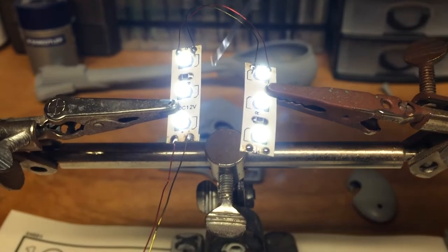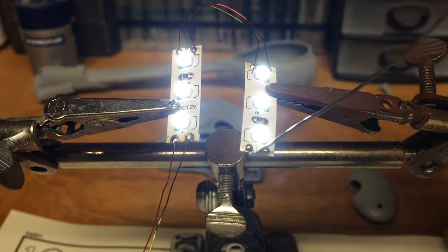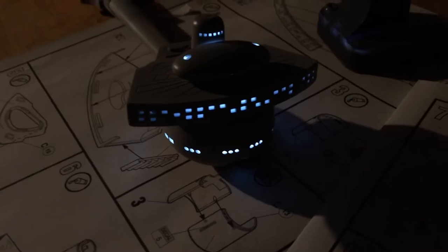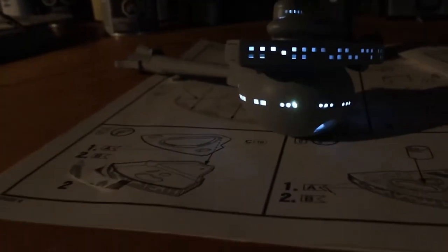What we've done is attach the two — it's really just power in, lights up these LEDs, and it's designed nicely so you can pass it through. So if these don't provide enough light for everything in the onion head, we can add more line and extra strip LED up into the command deck. This is the current lighting setup with just the two strips of LED, and there are actually only two coats of etching primer — this Plastico etching primer goes on beautifully and its light-blocking properties are amazing. The only place you're seeing light leaks is where I obviously haven't sealed the model up yet. I may still put one more coat up in here, but overall it looks pretty decent.